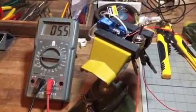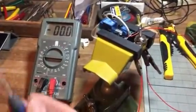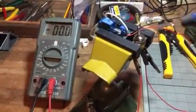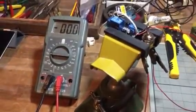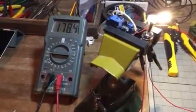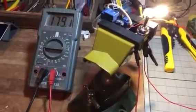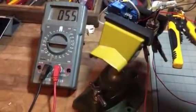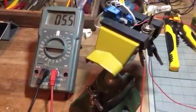5 milliamps is fairly respectable, but if someone were to turn it off manually, the current does go back to zero. The relay is in series with the actual lighting circuit, so you turn it on and it will go off by itself. There are other jumpers on the board and a potentiometer which allows you to adjust the time — I want around 5 to 10 minutes, but any amount of time seems possible.